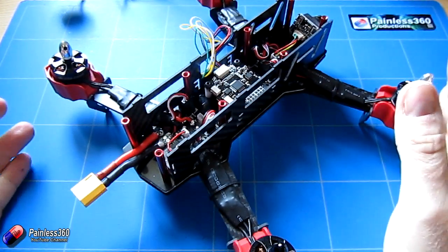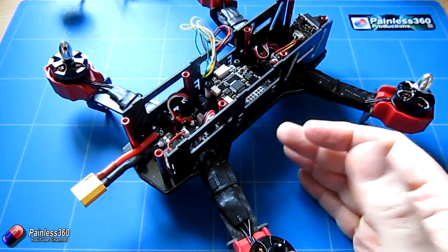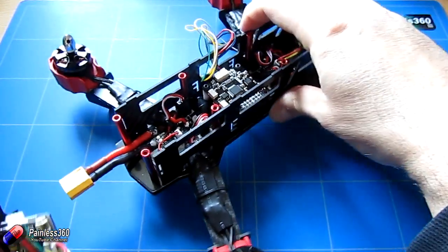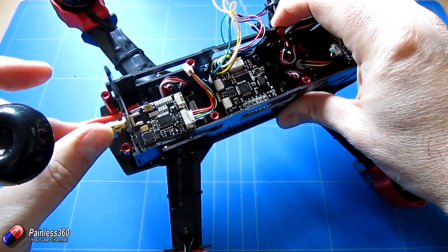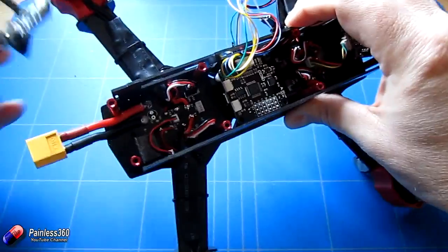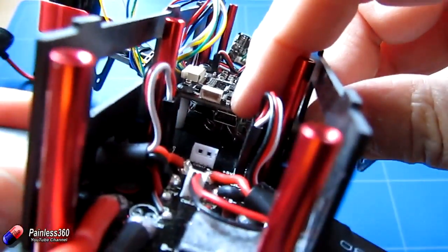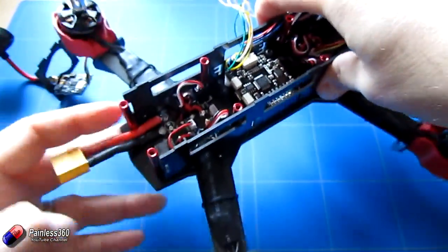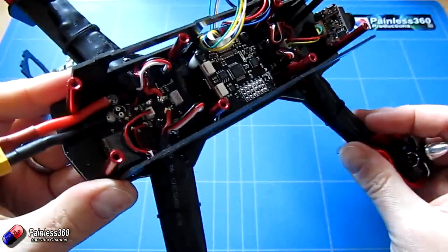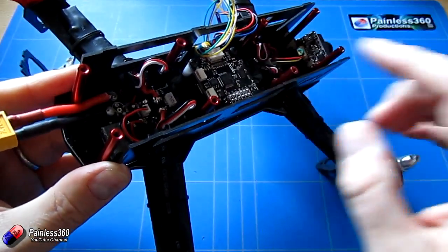I'll just use this as a park flyer so sticking a nano receiver on the outside should work fine. Without being able to connect to the flight controller and configure it for your receiver, it'll be tricky to fly. When I took the top off I also had to remove the FPV transmitter module — just unplugging a couple of cables and tugging it free from its sticky mount. That revealed the USB connector, hidden at the back — and it is a devil to get to without removing the back of the craft. That's a really bad bit of design.